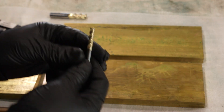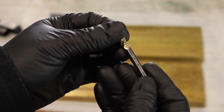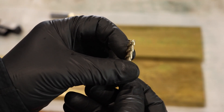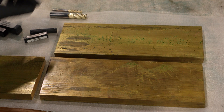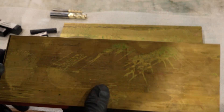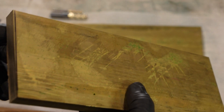Now we're going to look at Lakeshore Carbide's three-flute ZRN coated quarter-inch end mill. The corner radius is about five thou — you don't even see that on your part. Absolutely beautiful. We're going to be using these. Now we have our brass, she's ready to go. So let's put this inside of the machine, set up the GoPro, and we should be ready to get cutting.